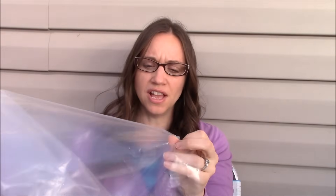The first material is polyethylene — just a single sheet of really thin plastic. Here's an example: it's a single layer sheet you would stretch and put over your greenhouse. The problem is this material has an R value of about 0.8, which is not very high, so it does not hold in heat very well. It's very cheap and inexpensive to purchase, but the main problem is that it doesn't last very long.